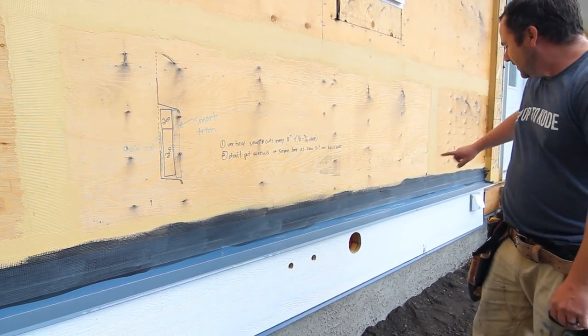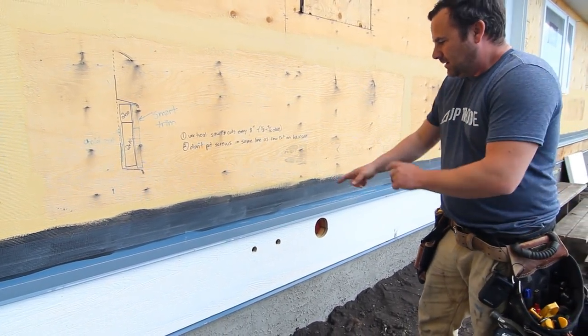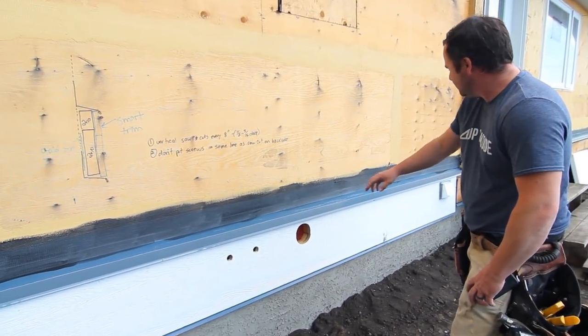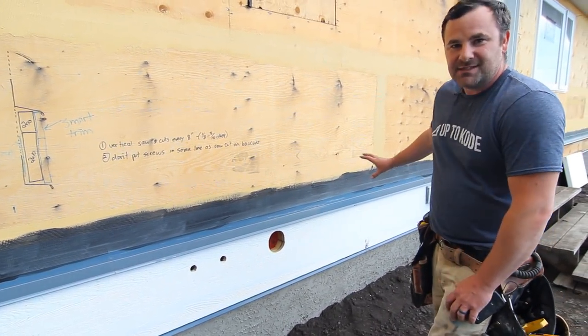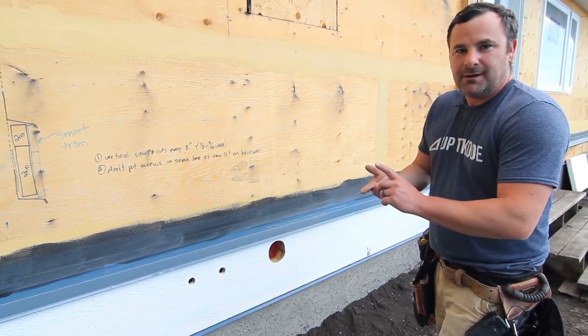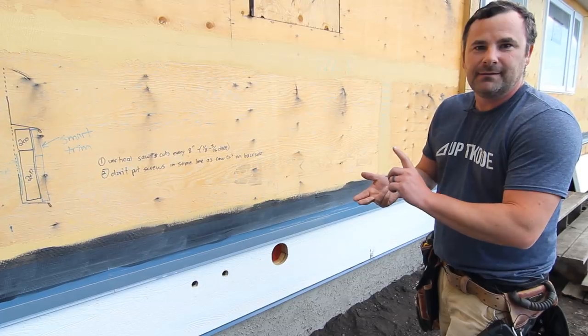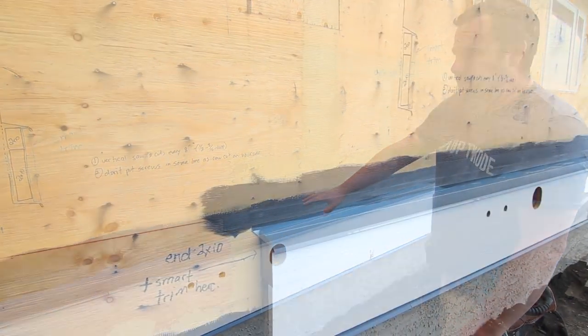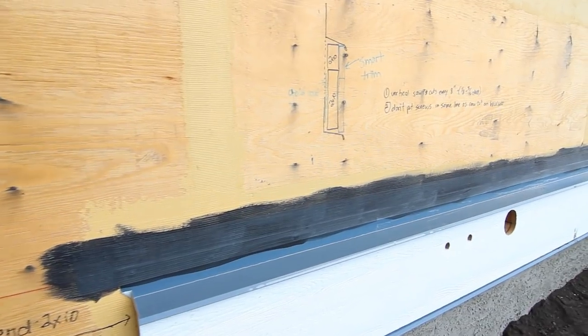Here's the big mother detail — this side of the house has hot and cold water spigots, exhaust for the downstairs washroom, the dryer, and this is also where we'll have intakes and exhaust for a future direct-vent hot water tank and high-efficiency furnace, all vented through the side wall. Same detail throughout. You can see more notes on the walls.